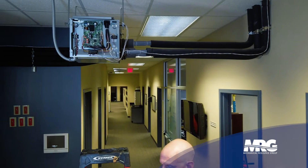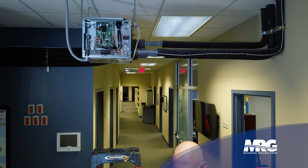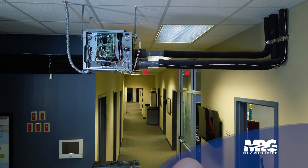What we've got here is a branch selector box for our VRV4 system that we use for all of our training. You've got three pipes coming into this box: the liquid pipe, the gas pipe, and the mixed gas pipe. The purpose of a branch selector box — I like to think of it as a reversing valve living in that box. It's going to change the flow of refrigerant, whether we've got a demand for heating or cooling off of whichever indoor unit is attached to that box.